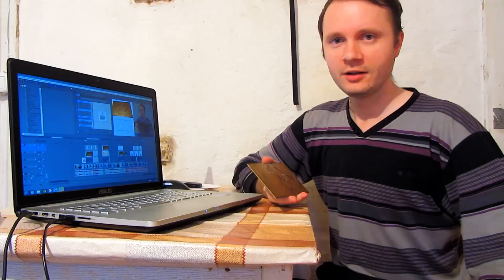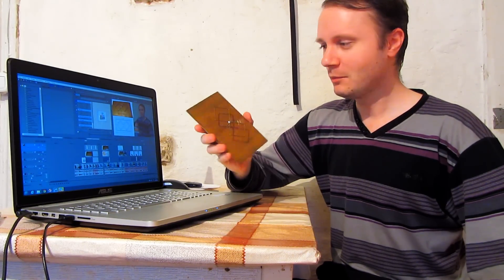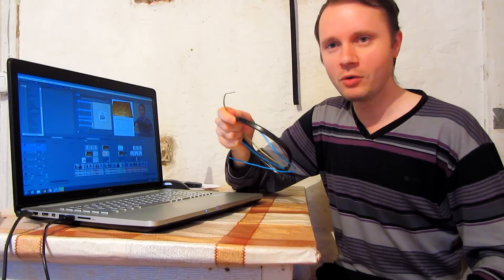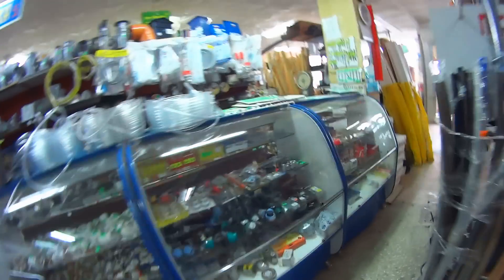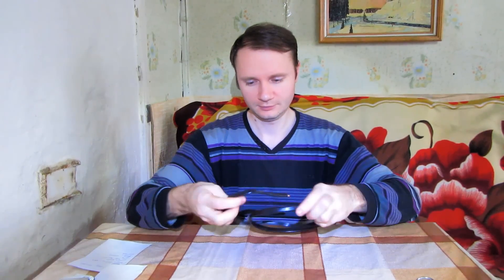In case you connect a homemade antenna to them, they get really very powerful. For making it, we need a foil-clad paper-based laminate or any metal sheet you have. Its height has to be 100 millimeters and its width has to be 120 millimeters. You also need a copper wire from 1.5 to 3 millimeters in diameter, which you can buy in an appliance shop. An antenna cable isn't appropriate for us, but this cable is just what we need.